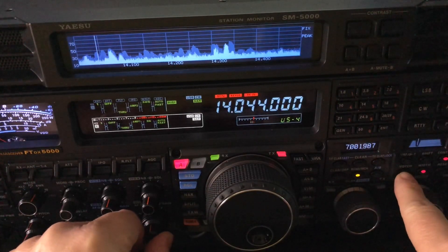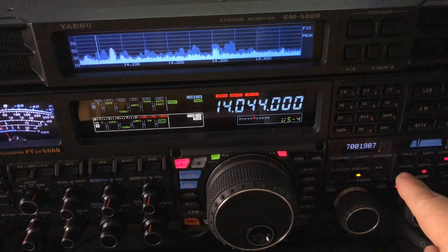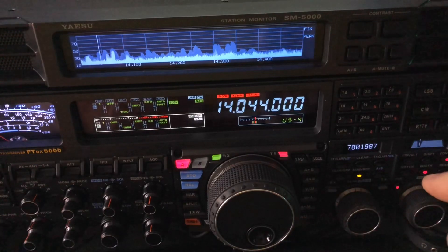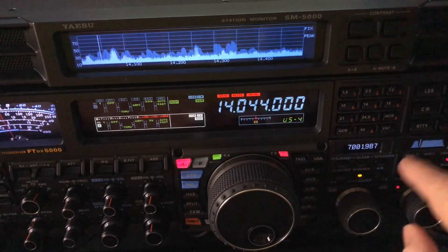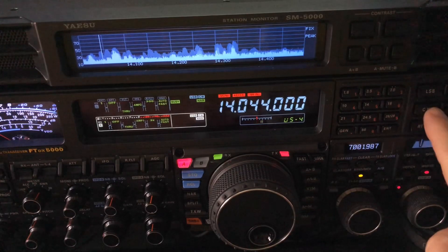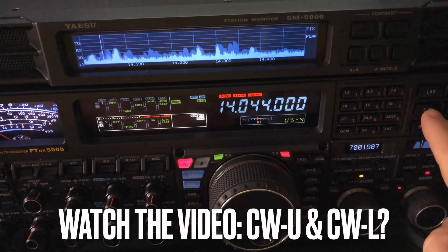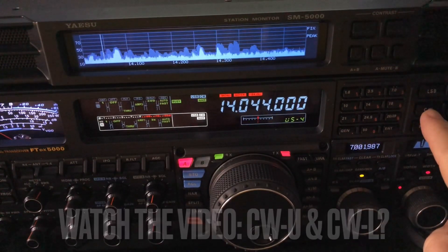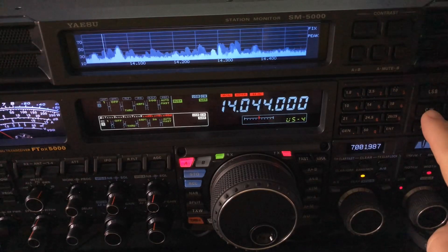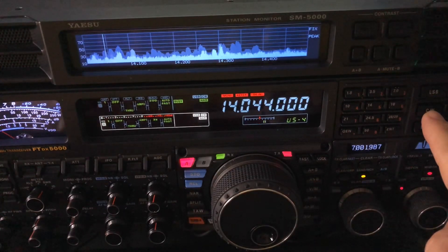While I'm waiting — if the person you're listening to, let's say just you and another person are in a QSO, like if it were me and this person here on 14.044, and somebody else comes in near us and is causing interference. Now I can try toggling CWU to CWL — CW upper sideband insertion or lower sideband insertion. Look for the video I shot about that called 'CWU or CWL?' What that'll do is change the pitch of the other station, since they're offset, making it either a low pitch or a high pitch.